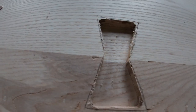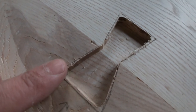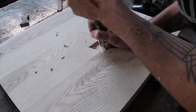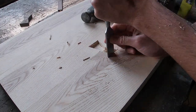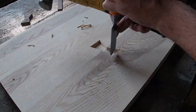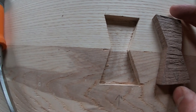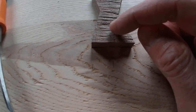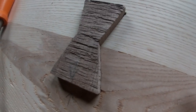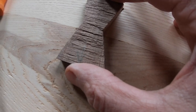Most of the material is removed and pretty close to the line. I'm going to take a chisel to clean up all these little lines and hopefully get a nice tight fit. The chisel did most of the cleanup work — we've got a nice pretty tight line. I marked the piece with arrows to keep it in the right orientation since there are two of them. It's a little tight at the moment, so I'm going to put a little chamfer on the inside of the bow tie facing down, and then we should be able to just hammer it home.